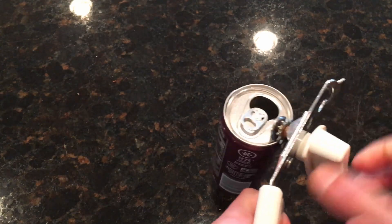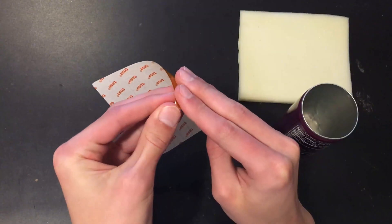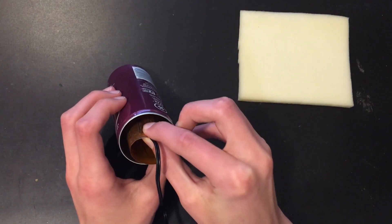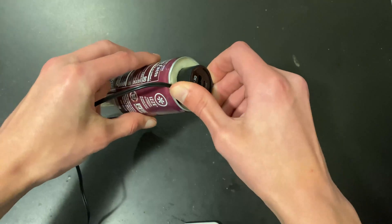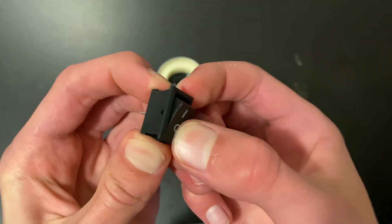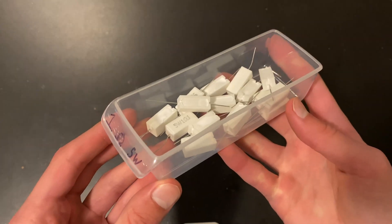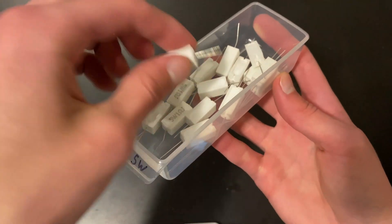So let's get started building this. The plan is simple: cut off the top of the soda can, take our heating bed sticker and stick it to the inside of the can — if it doesn't cover the whole thing, heat should spread a little. Then put the power bank in the middle surrounded by some insulation, and wire up a USB port to the heater with an on-off switch so we can control it without plugging and unplugging. Because the heater draws about 3 amps and the power bank can only supply 2, we need to add a current-limiting resistor — a 1 ohm 5-watt resistor — to limit current to 1.5 amps.